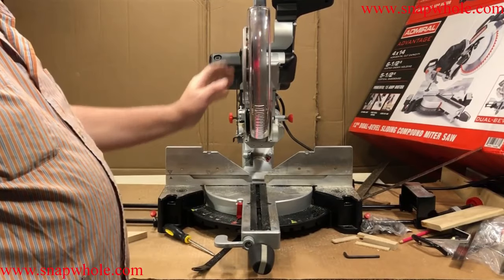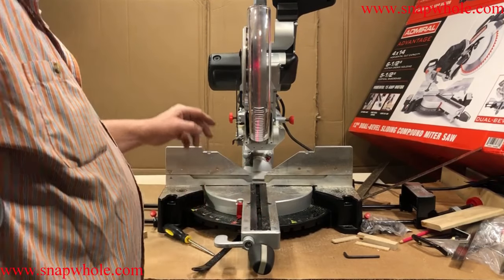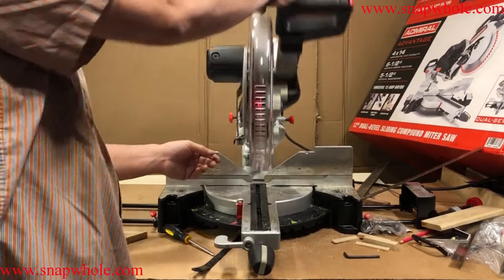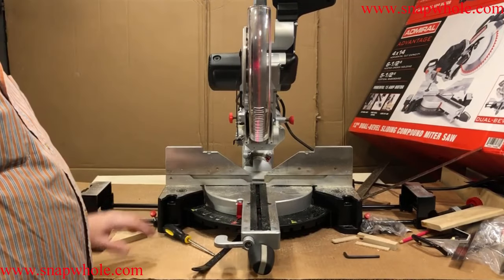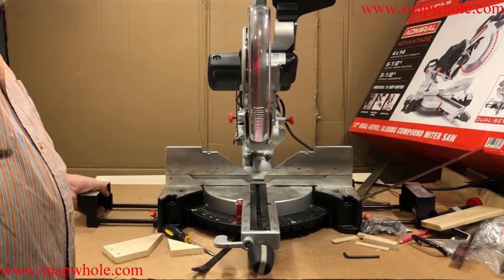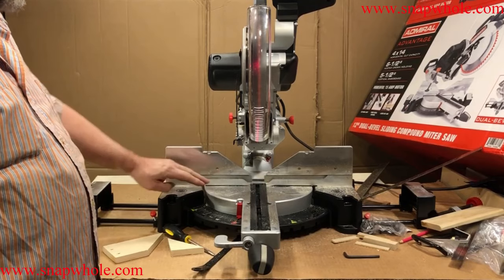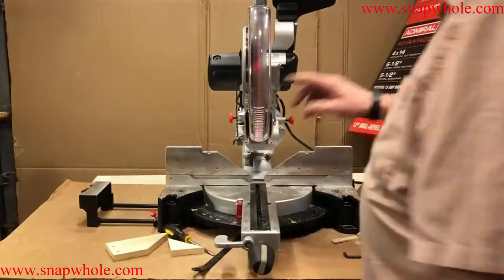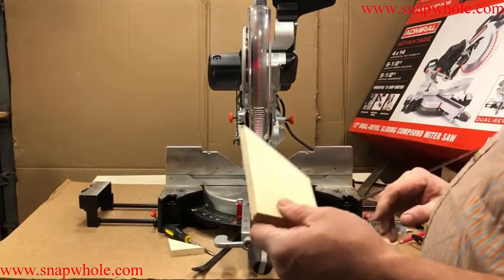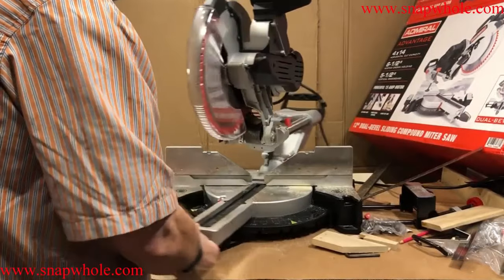I'll try the laser again just for fun. Once again the laser is messed up still by the same amount, and I don't think I'm going to be able to fix that. It's square. Here's a recap of things shown: I showed you how to put the blade on, the depth adjustments, the back stop — you don't want to adjust it to go too low or it will hit the bottom of the kerf. The front screw lets it pass through or stop. The outriggers are somewhat level but the further out you go the worse they get. The laser is out by about an eighth of an inch, and locking this down does have an effect on accuracy.